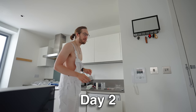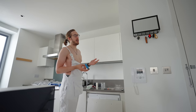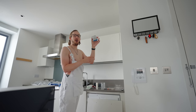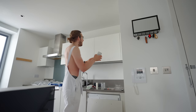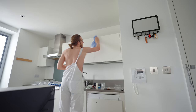This is day two. I had an issue where I just felt like the texture was too much — I want it to be smooth. I Googled it and results from spray paint sellers were saying spray paint is pretty much the only way to get a super smooth finish. But from other blogs and YouTube videos, it's essentially just sand with an ultra-fine sponge. This is 220 grit — not as fine as I'd like — but this one I've already sanded is much smoother than the coarser one. I'm going to sand the whole thing down again before putting in the hardware, then give it a nice wipe to get the dust off.